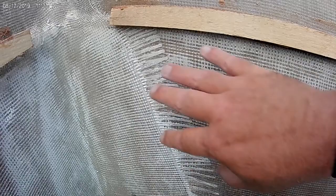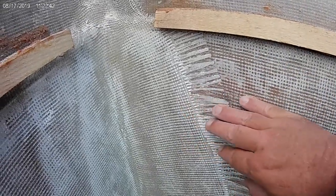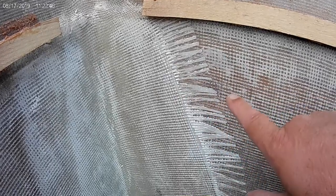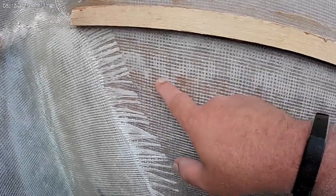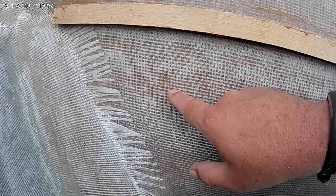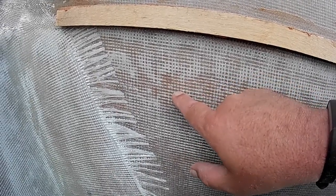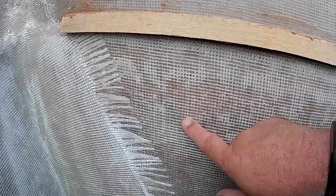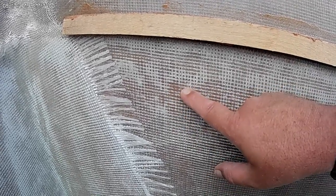Have a little closer look at what I'm doing in the bow here. I laminated this part of the stem, which is going to be 4 years ago now. And as you can see in here, the layers of the fiberglass are running at 0 to 90 degrees to one another. So that makes this a 12-ounce layer, and there is no mat on this one.